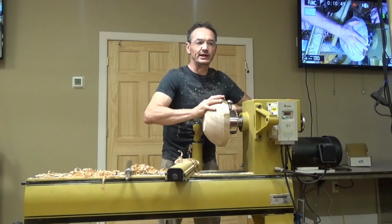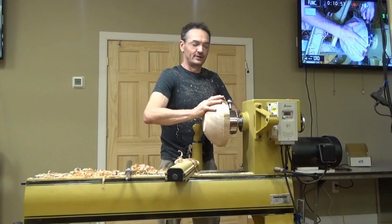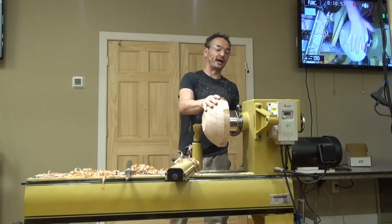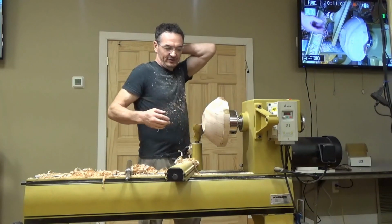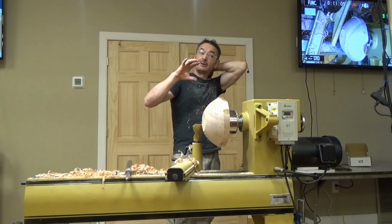Why did it loosen slightly? What happened? Yeah, it compressed, so the grain crushed down. So it doesn't dry out that quick. You're quite humid here, and this wood's not soaking wet. The reason being is all woods can be compressed, especially over a period of about 12 hours.